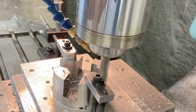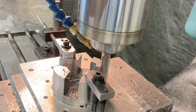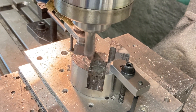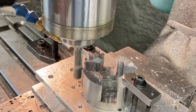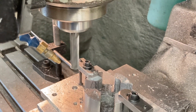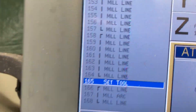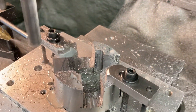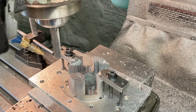Once I know these guys are all sized, I'll put a 45-degree tool in there and run the finish profiles to put a little chamfer on all those edges. Now this one thinks it's done — we'll have to check the slots to make sure they're within tolerance. Over here it's saying change tool — it wants that 3/8 tool, that long three-eighths four-flute carbide end mill, so I can go back in and finish mill that notch. We'll call it a day on this one — we're at 13 minutes.